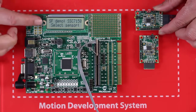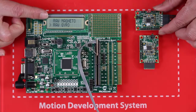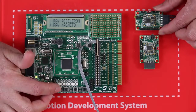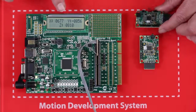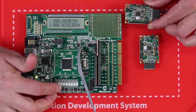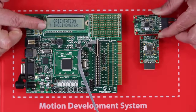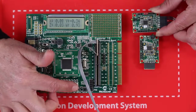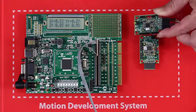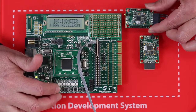You have the ability to select different data outputs from the MM7150 Motion Module. You can select raw data from the sensors — magnetometer, gyroscope, and accelerometer — or you can select the fused, compensated data ready for use in your application. For example, inclinometer data could be used for tilt or tamper detection, orientation data provides 3D positioning for robotic applications, and you can also see eCompass data for navigation applications.